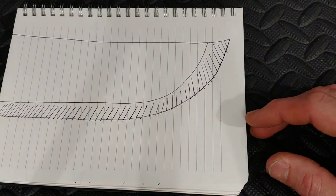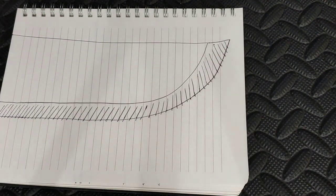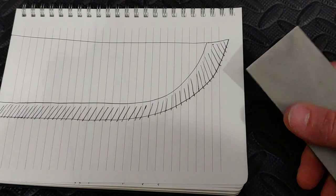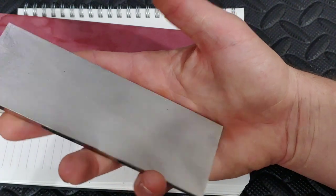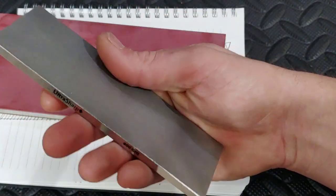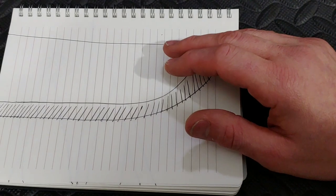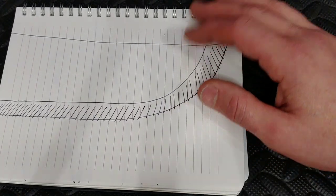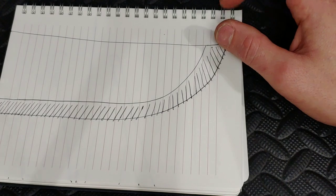Now, what I'm talking about is from an actual diamond stone. So what I would do is I would take my highest grit, which would be an absolute mirror, and then I would go across it with one of these, a diamond plate, 600 grit. Yeah, this is 600 grit. And the finish would be like I said, like this. It would be incredibly sharp, incredibly flat, but it would have the mirror underneath it still on a microscopic level. I'd have to really zoom in with my eye loupe. And I'm really enjoying that type of finish on an edge.